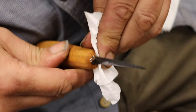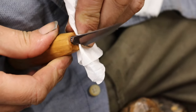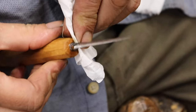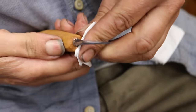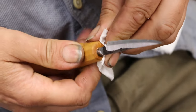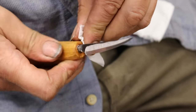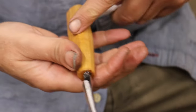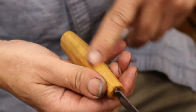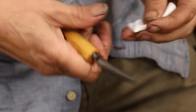Something you mentioned off-camera about the colour of tissue or kitchen towel you're using? Yes — if you use a coloured one, because you've oiled first, the oil in the wood can strip any dye out of the kitchen towel. I did this once with the blue industrial cleaning ones — the oil stripped the dye out and the wood took on a blue colour, which was not my favoured look. So use white tissue.